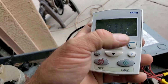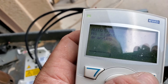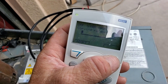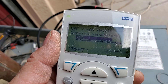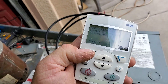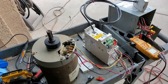I need to upload the parameters to the panel — not sure if I can do it while it's running. I'll stop the unit and go to upload to panel and select. It's loading all my settings to this panel. I have two more of these drives, so I should be able to grab them, power them up, plug that panel in, and write the parameters to each drive.